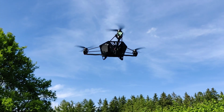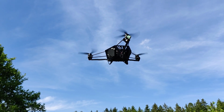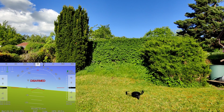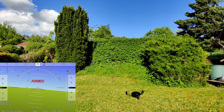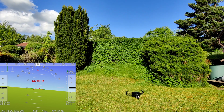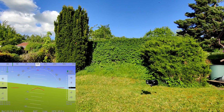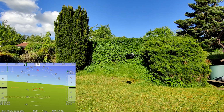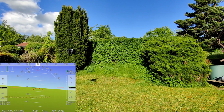A new addition to the ASTEROPE project is our self-built drone. The modular design is based on a tricopter. It features multiple payload attachment points, which give us great flexibility when preparing for this year's ERC and will enable us to expand the drone's capabilities for future missions. With a takeoff weight of 1.6 kilograms, an estimated flight time of 15 minutes, and ample additional payload capacity, it should easily handle all challenges to come.